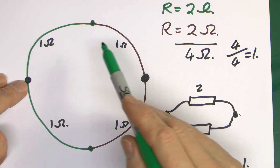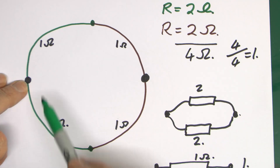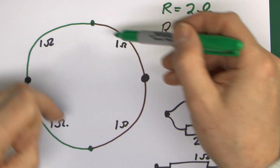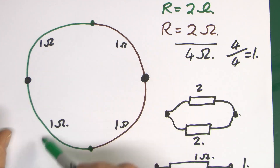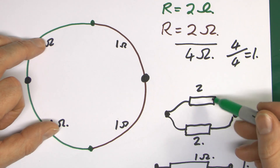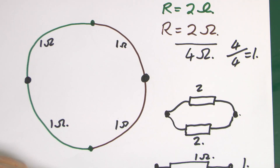Because in this particular test you're putting the entire thing into a giant loop — essentially a circle — you've got half the length of the two conductors involved, depending on where you measure. It's still the big circle you're measuring across the diameter of. Half of each cable is involved, so it's 1 ohm each, giving a total of 2. Then those two paths are in parallel, so you're halving it because you've got half of each cable, then halving again because there are two parallel routes — which is how you end up with a quarter of the total value.